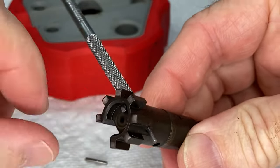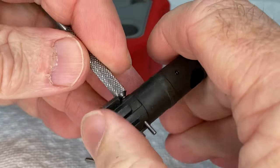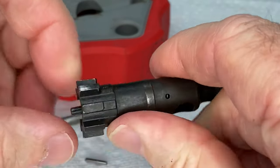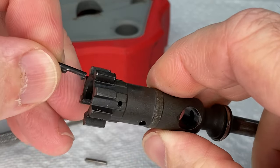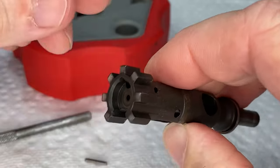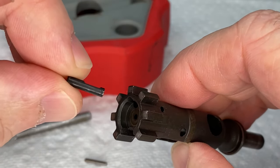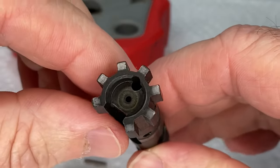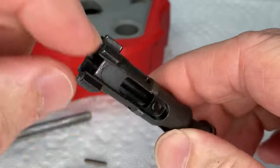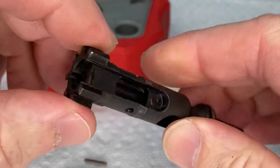Now the pin is out and the punch has replaced the pin, so the ejector is still in here. Because it's under spring pressure, you want to put your thumb here and pull this out. The plunger comes out, and then your spring drops out. If you just yank that thing out, this plunger — which happened to me — is going to be on the other side of the room and you'll be lucky to find it. So there you have it, it is now removed. The trickiest part is to put it back in after you clean — that's the reason you want to get it out, put a pipe cleaner in there, and get it nice and clean.